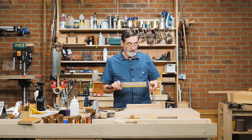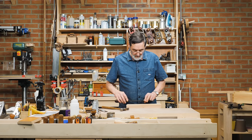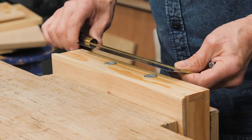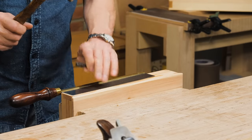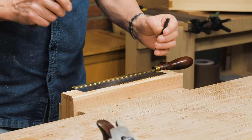When you're saw setting, sometimes we use a nail punch and a hammer to set the teeth because they're very small. Put two magnets into the surface of a piece of wood — let that hold the saw there — and then tap every alternate tooth. Flip it over and the saw will stay in place. Perfect.